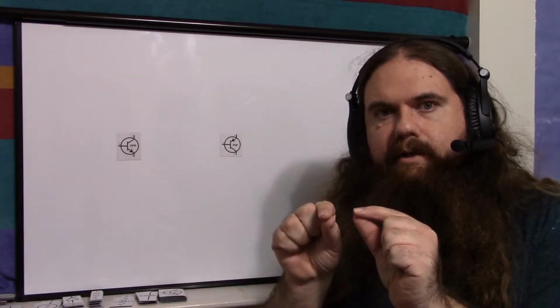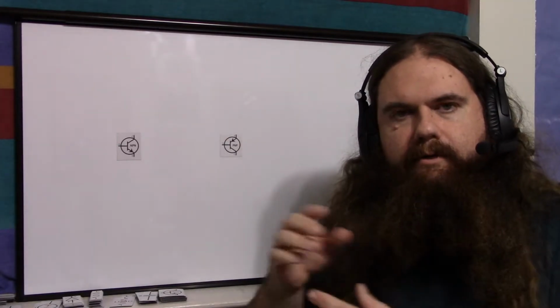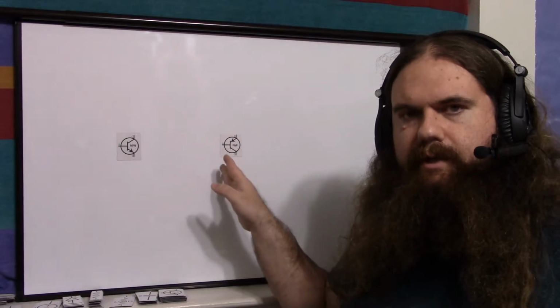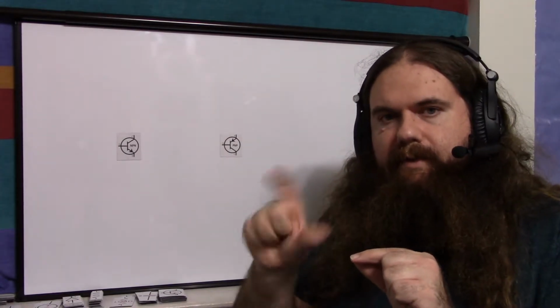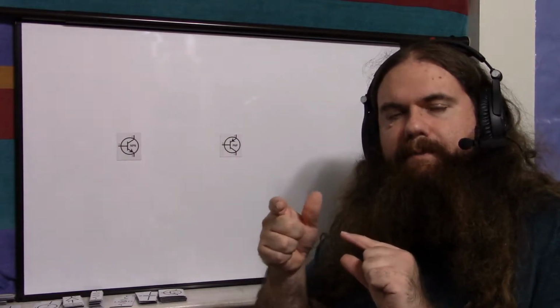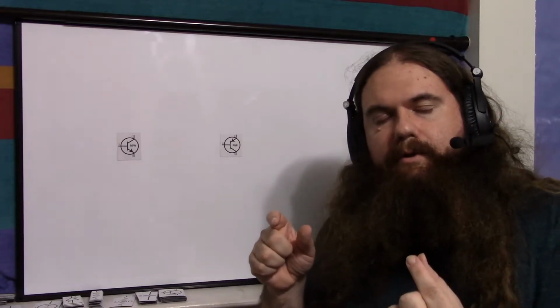If there is current, then one of the two you're touching is the base. Then flip it, and you'll know. Again, that's the base because it won't conduct in the opposite direction. Then pick another one. If neither of them connects, now you've removed the base and you're on collector to emitter. So the pin that you're no longer touching, you know is the base.